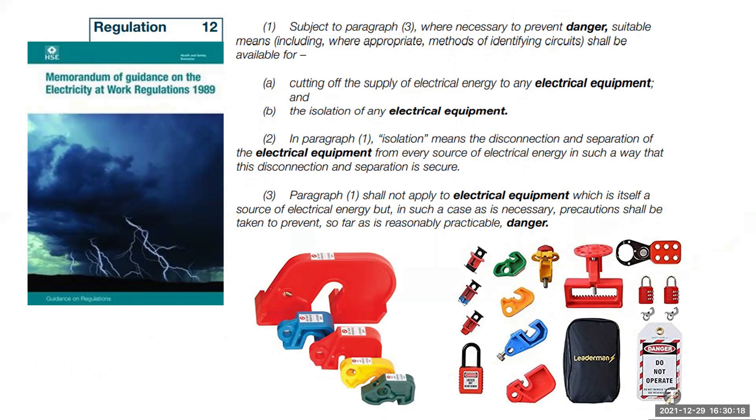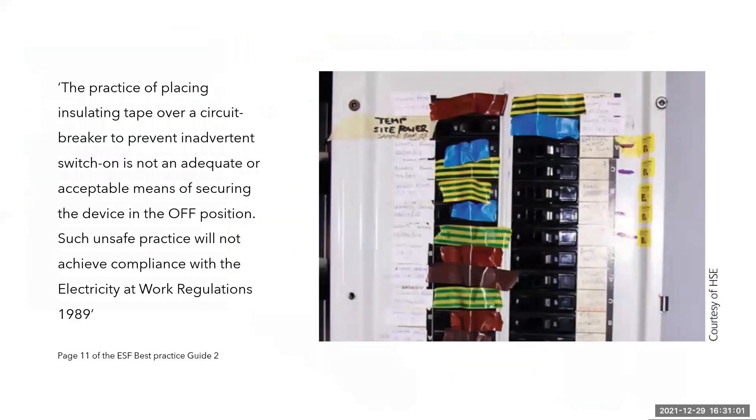Best Practice Guide 2 also quotes the Electricity at Work Regulations 1989 definition of isolation given in Regulation 12: it means the disconnection and separation of the electrical equipment from every source of electrical energy in such a way that this disconnection and separation is secure. In effect, this means not just cutting off the supply, but also ensuring that the means of disconnection is secure. In most instances this will require securing the means of disconnection in the off position, and it is highly recommended that a caution notice or label is posted at the point of disconnection. Electrical tape does not qualify as a secure device — it can easily be peeled off or fall off, meaning someone else can be in control of your electrical installation. If someone else were to energize the installation and there was a death as a result, as the duty holder you would be the person who could be prosecuted.